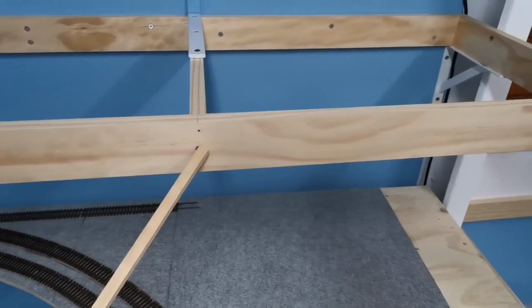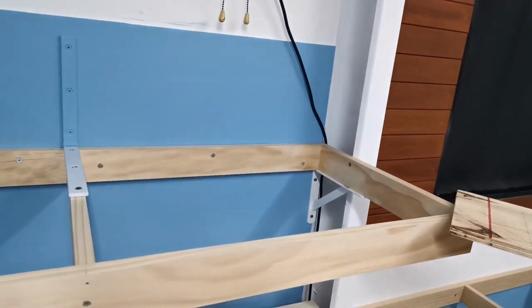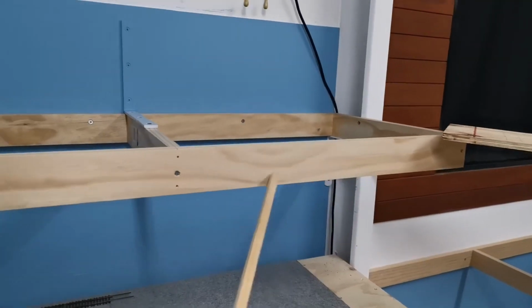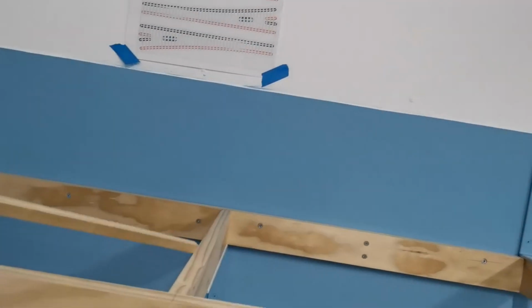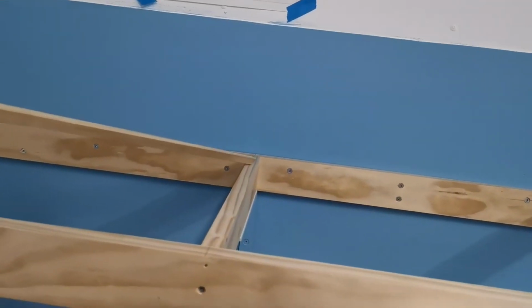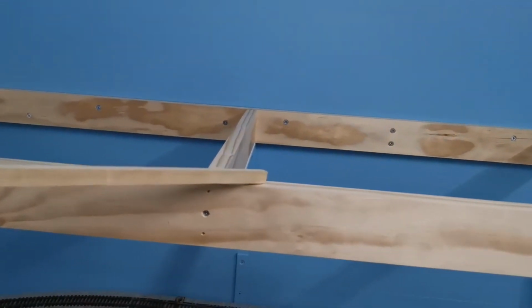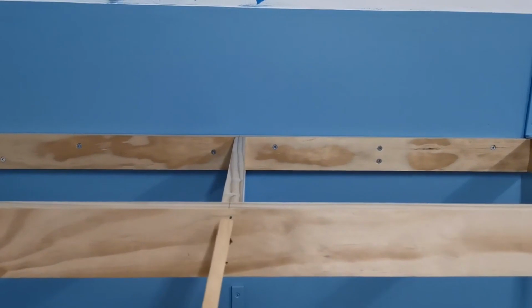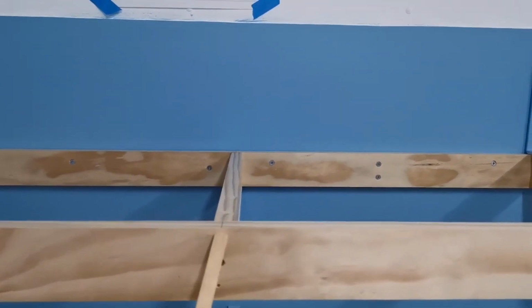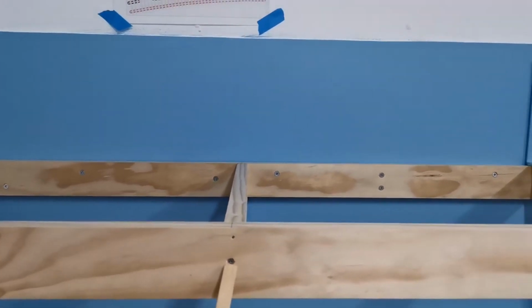And I haven't done any clips to sort of show you when I was putting this stuff together, but it is quite basic. I just have these 2 long pieces on each end, and then basically I have these pieces cut out to size. So from that end up to here is about 450mm, and basically each of the ends get glued, nailed twice just to hold it in place, and then I'll put a screw through it just to brace it all together before I put it up.